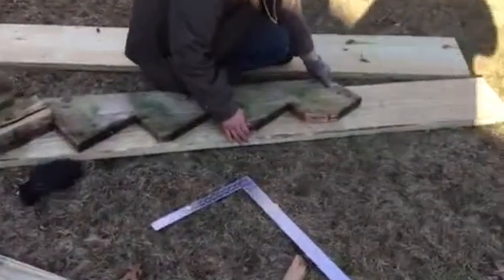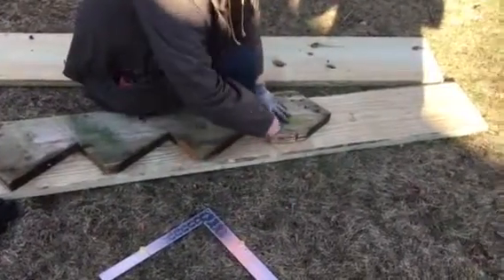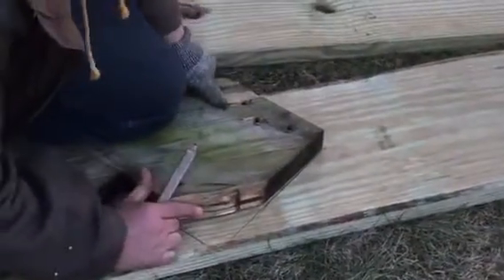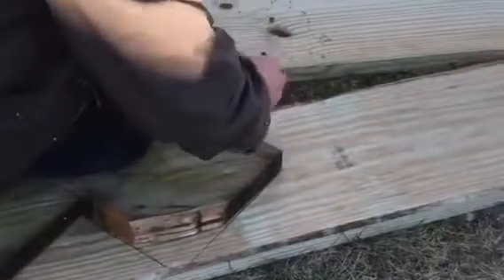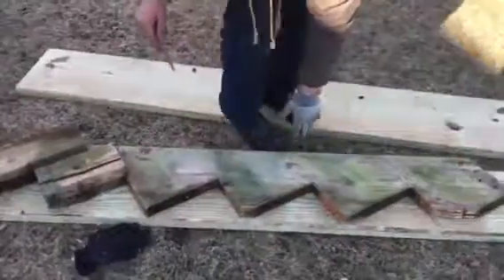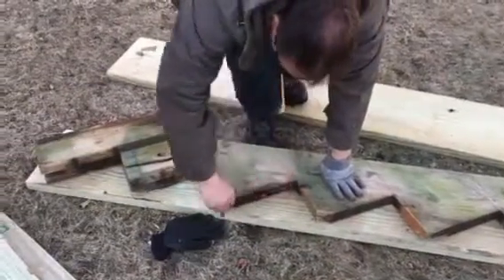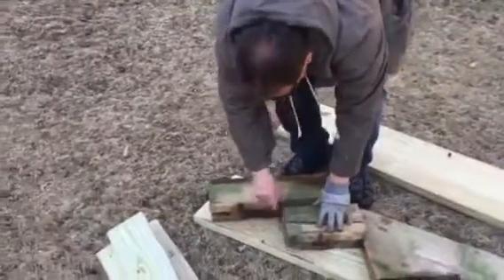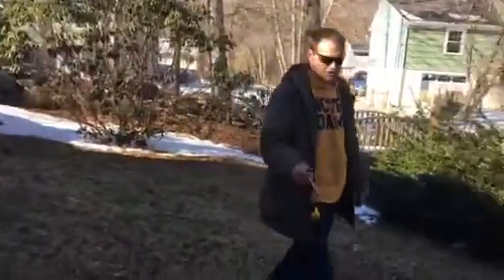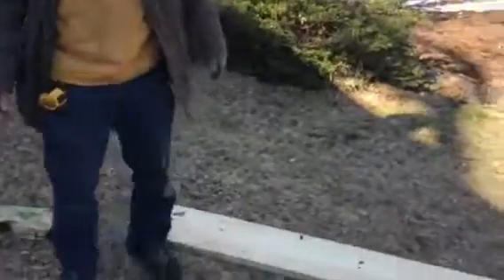You want to make sure you're even all the way here. You just trace right there, not missing that corner. These are the old rotted ones — as you can see, they're falling apart. You can't reuse them or put new decking boards on them, so I gotta rebuild them. That's kind of the cheater's way, but if you got the old stairs, you might as well. But if you're building a brand new deck, you can't do it this way — you're gonna have to rebuild the steps from scratch.